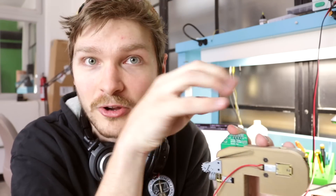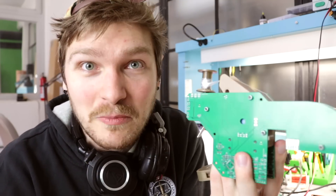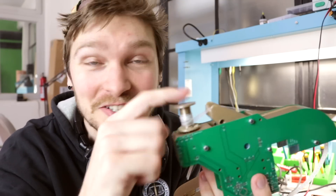That seems to work pretty darn well. I tried giving it a bit of resistance while it was pulling the tape and I was able to stop it, but it put up a fight. I was only driving it at about seven and a half volts and we have 24 volts in the feeder, so we can PWM 24 volts into the motor for extra boost — but even at seven volts, which is totally within range for these motors, it's totally fine. There's plenty of juice with this different gearing of the N20.